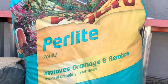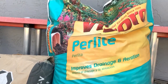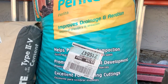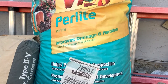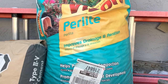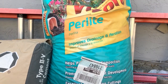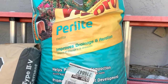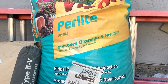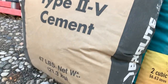First of all, this is perlite. Perlite is like little tiny white rocks — it's kind of the white stuff that's in potting soil. They use it for plants for aerating, because it allows air to get through. Air is a good insulator. The whole purpose of the refractory cement is to insulate and keep the heat inside the furnace — that helps the furnace get hotter and helps the outside not get hot. So the perlite will cause a lot of air holes to be in there. I'm holding that together with Portland cement.